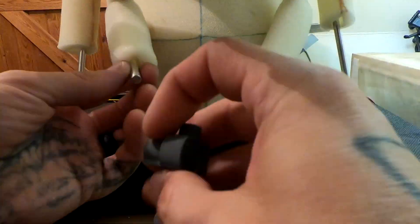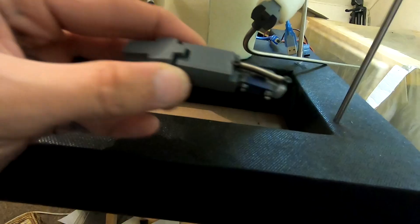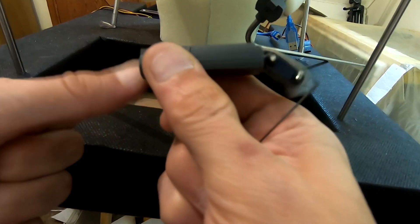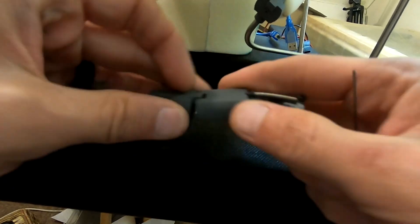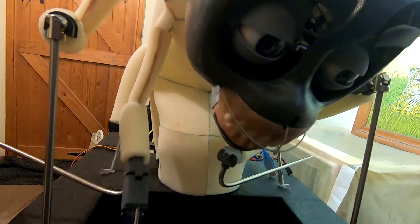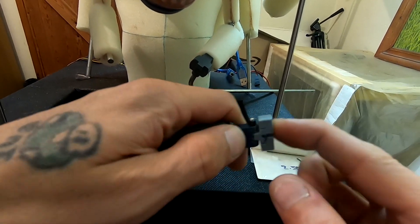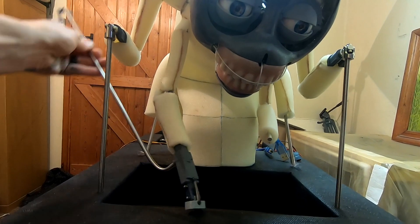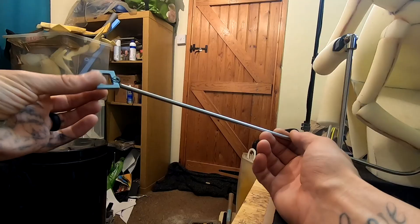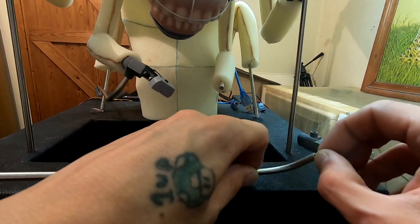The arms — I made a little mechanism a few videos ago, like a little grabby action. Here it is: just a spring, a couple of pivots, and this is the big brother version in a much stronger material but the same principle. I've got a bit of fishing wire — fire line I think it's called — going through some rods. With the arms grabbing forward on those springs, it'll basically look like it's trying to grab something off the ground, rummaging through something. Two of the arms are on walking sticks or crutches, and the other two will come forward like he's sifting through dirt or garbage.